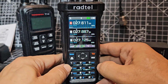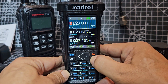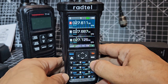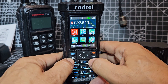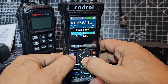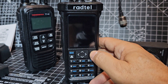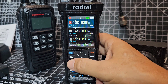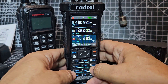If you hold down the one, you get a spectrum display. Hold down the VM and you get GPS and APRS. Plus, if you get the free app, you can Bluetooth program this radio. If you press the orange button, go to radio set, select work band, you're back into VHF/UHF — and it will actually work on 50 megs and 70 megs. It also has cross-band and a lovely screen.